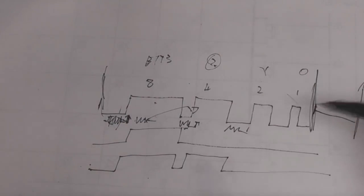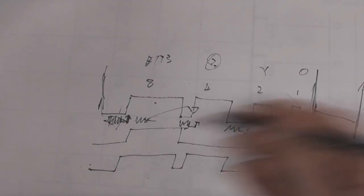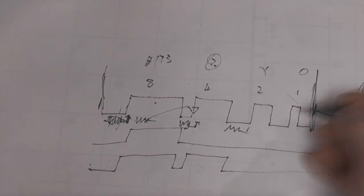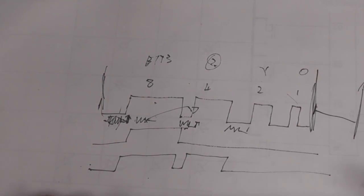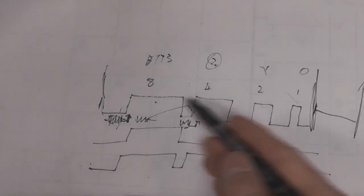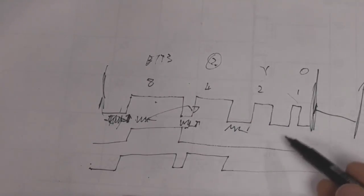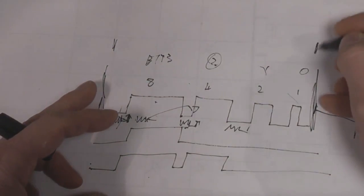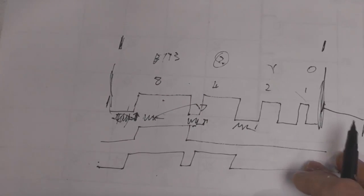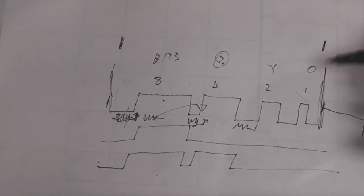In practice, for colour, you generally use 256 levels, so you'd have 8 periods, from 1 up to 128, down to one cycle time. If you're doing monochrome, you generally want a bit more than that to get a good grayscale. So that's the basic principle. It doesn't really matter which order you do these in. This amount of time is going to be one row, which is going to be of the order of no more than a few milliseconds, because if you're doing 16 rows, you need to do this 16 times.